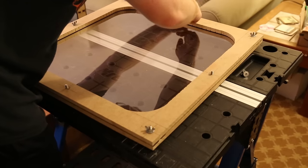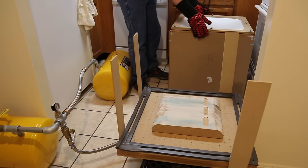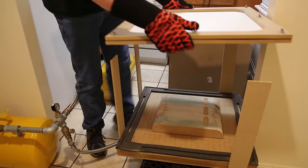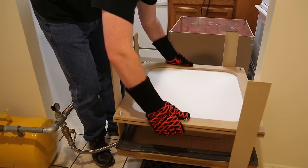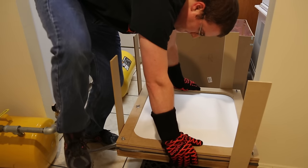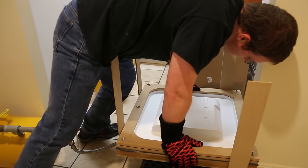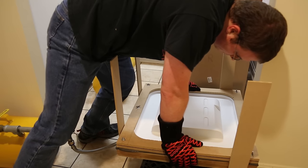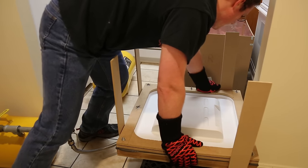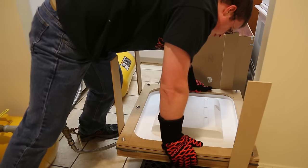Place the plastic sheet within the frames and clamp. Allow your heating element to bring the plastic up to formable temperature. When the plastic is uniformly heated and an appropriate amount of sag has been achieved, move the frames with the plastic from the heating element to the platen. Move the heated plastic down over your buck, which is spaced above the platen — usually on nickels — and create a seal on the platen. Apply vacuum and maintain the frame-to-platen seal while the air is evacuated from underneath the plastic through the top of the platen. As the air is evacuated, the plastic will begin to form around the master. Leave the plastic on the buck and platen for about 30 seconds, then you can demold the plastic from the buck.